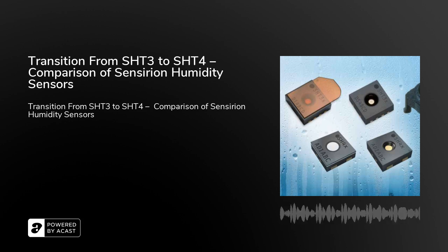I2C Communication: The Sensirion SHT3X sensor series supports one-time measurement mode with or without clock stretching, and periodic measurement mode. The SHT4X series I2C communication is simpler — it supports only single-shot measurement mode without clock stretching. The SHT3X series has an ADDR pin allowing two I2C addresses: 0x44 (ADDR = L) or 0x45 (ADDR = H). SHT4X series sensors can be ordered as SHT4X AD1B with I2C address 0x44 or SHT4X BD1B with I2C address 0x45.